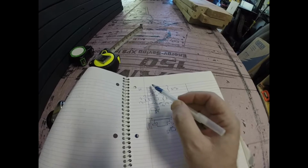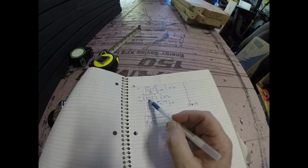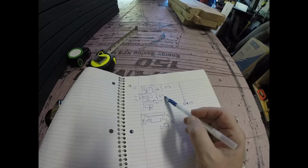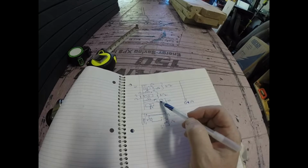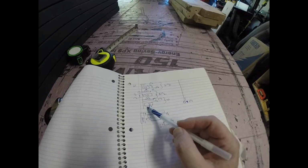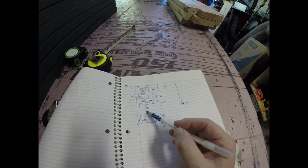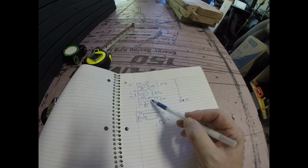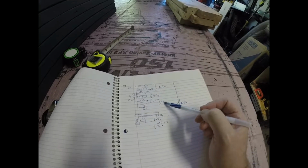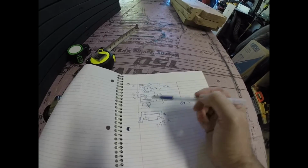And then do that on the next one. I'm doing 3 tubs. So the next one, 1.5 inch shelf, 1/2 inch gap, 8 inch tub, about 1.5 inch gap between the light and the tub, 10 inches for the light again, gives you 21.5 again. Now for the final one, we have the shelf, 1.5 inches, gap, 1/2 inch, 8 inches for the tub, but I want there to be room off the floor, so I'm not bending down and scraping it on the floor and save my back. So leave about 7 inches for that. So altogether the tub plus this gap is 10. So that would be 43, 53. And then I just add 7 inches to make it 60 altogether. So that's how I got 60 inches for the legs.